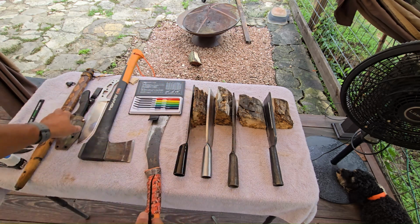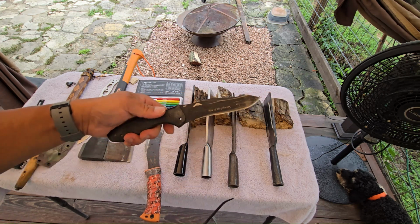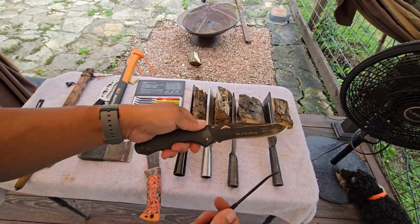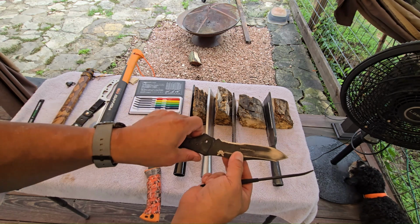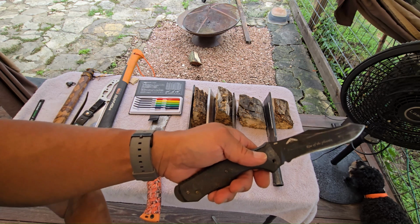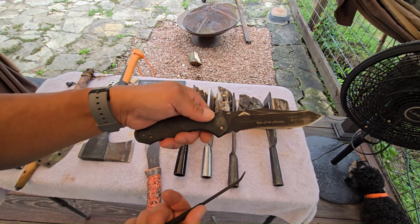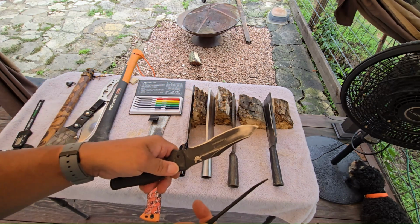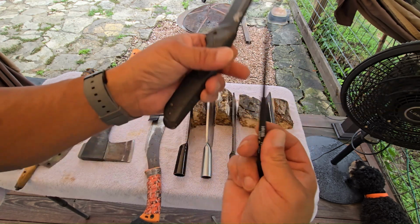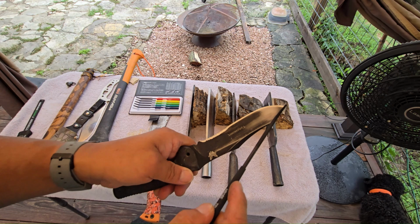That's really hard, right? So I'm gonna get my custom bench made. This is really old. When I was reviewing knives, I had a knife maker re-harden this to like 64 HRC, because at that time I was like, oh, the ceramic blades and all this stuff, and I wanted like a 65 or 68 hardness, right? This is S30V, which really shouldn't be going over like 60, but I was just like, just do it, right? I want a 65, and so he said, all right. So basically he just got it as hard as it could be, right? So this is a 65, right? So theoretically, this should just barely make a scratch.